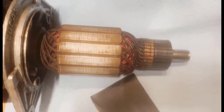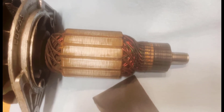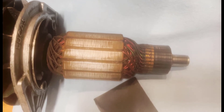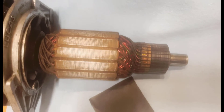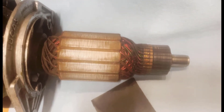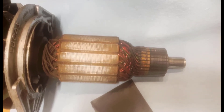Very gently, using very fine sandpaper, cleaning off all the rust and the muck on these surfaces of the armature — they were pretty disgusting. We're still going to have to go after the contact end here, which is copper, whereas these are steel. So they're rusty and mucky, but they're cleaning up pretty nicely.